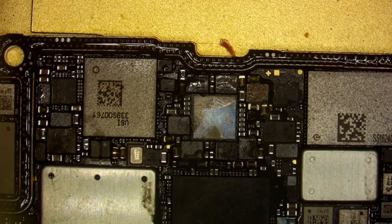While I open ZXW so I can get to the next part of our project, which is comparing the missing pads to ZXW to make sure none of them are important. I highly doubt they will be, but if one of them is, then I'll show you how I take care of that. It's a very easy process. You don't have to reball the entire board again.